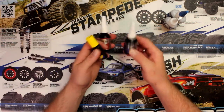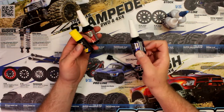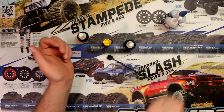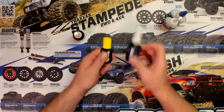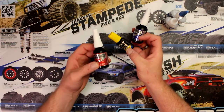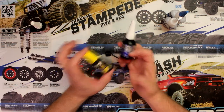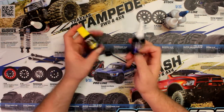So basically you have three kinds: green, blue, and red. Blue is the one for everyday use — when you use your screwdriver you'll be able to take it off by hand, but vibration won't loosen it. If you need threadlock, use blue. Do not use red. Red is basically permanent — it's going to be extremely hard to remove. Always use blue, and only on steel-on-steel or aluminum — not plastic.